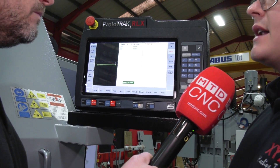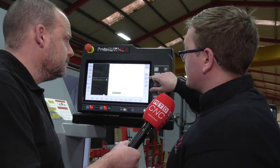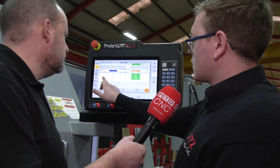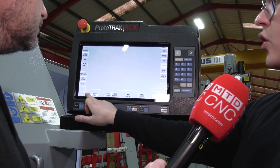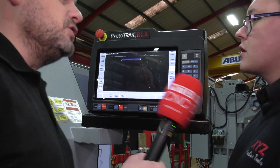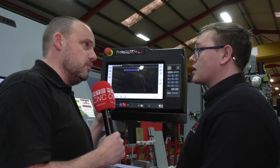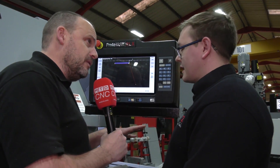You've roughed down some 75mm bar to 50mm. You can then check this using the setup feature — we'll assign a tool to it and we can do a toolpath. That is our component with a four-minute run time, so it's giving you your run time as well. Other cycles like grooving and boring all program in the same similar way.